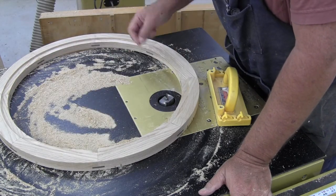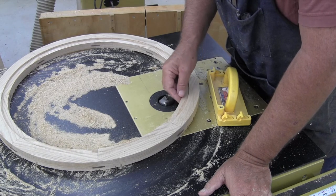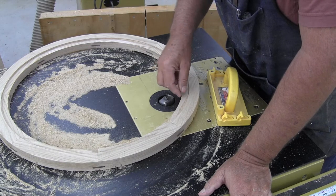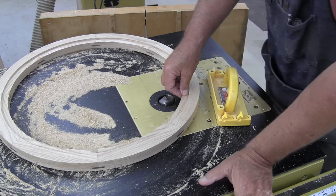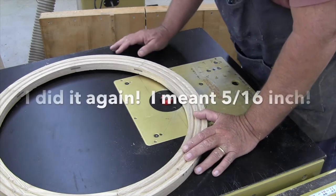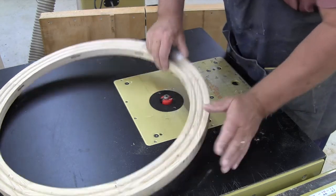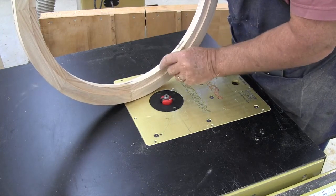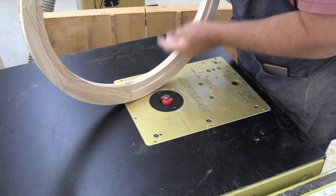For the keeper ring. Now I've got to make another rabbet that's going to be 5/16 of an inch deep off the inside reference face and 5/16 of an inch this way, and that'll be to actually house the stained glass piece that I'm doing. So now I've switched to my 3/8 inch rabbeting bit, and the rabbet is actually going to begin where the keeper ring rabbet ends. So this is my starting point right here, and I want to go just a shade over a quarter of an inch into this material.